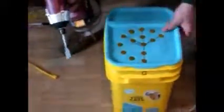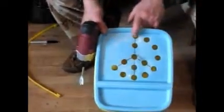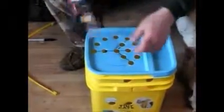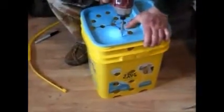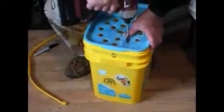I'm going to show you, and we're going to start drilling. I'm going to keep this one for my little Soapy girl, and this is going to be a peace sign when I'm done with it. I got a 3/4 inch bit, and I also got a 1 inch spade bit, on an impact drill, and we're just going to kind of finesse them in there a little bit. Don't push real hard, because otherwise you get sloppy and it starts walking the drill bit all over the place.